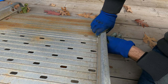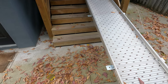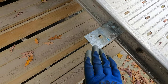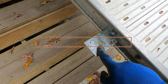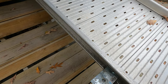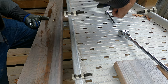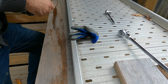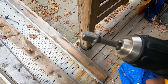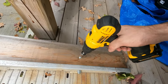For drilling through aluminum I used a hammer drill - a plug-in electric drill saves a lot of time. I used two-by-sixes because of how far the hole stuck out - two-by-fours would have been a bit far out. I wanted as much support as possible so I could tuck it all the way in and have the hole more centered. To mark where to drill, I just placed the wood across, marked it from the bottom with a Sharpie, then drilled the holes. Quick tip: put your bolts facing inward and nuts on the outside, then drop this through. You can get adapters that make your drill fit a socket bit for about $5 - makes the job a lot quicker.